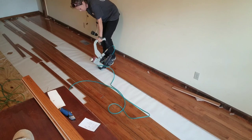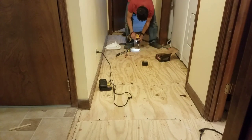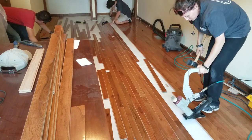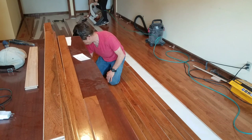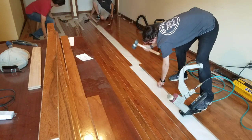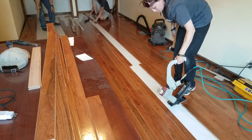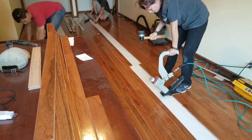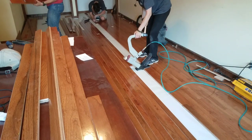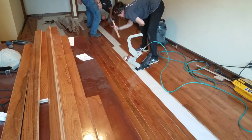I left Kelly and Jared to nail off the floor while I finished working on the hallway. I got all the plywood cut, laid, and finished screwing it off. Racking out a room means laying all the boards down on the floor in the way they're going to be nailed down later. I like to lay everything out and turn a board around backwards at the end but not cut it yet — sometimes boards are warped or twisted and have to be pulled, which messes up your row. After fixing it, I take two or three boards turned backwards and cut them all at once to be more efficient.